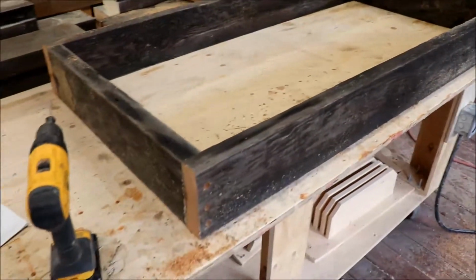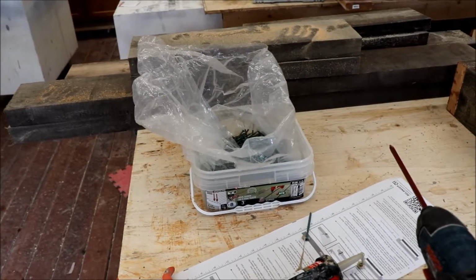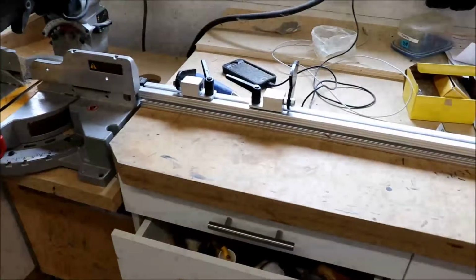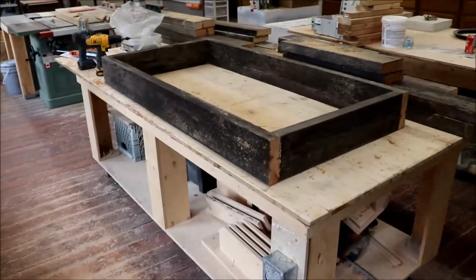And all I'm using is 3-inch deck screws I had left over from another project. I had to buy a new box because I ran out, and I've got lots of them left. So pretty simple. And what I did at the chop saw area is I just put one of the stops at 24 inches, which defines the inside dimension. And then on the other end, I just put a mark down, and that defines the 4'6". So again, it's just going in the garden. Don't have to be that precise. And that's how it goes. So we're going to finish the other 4.